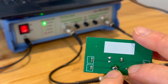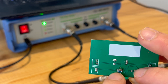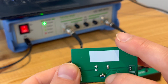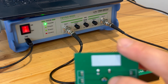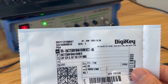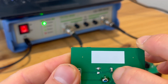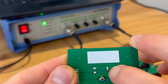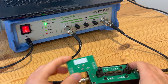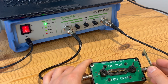Because the X2Y capacitor does not have the feed-through feature, I just added a tiny little wire to connect the trace. We have an 0805 100 nanofarad X2Y capacitor — this part is 100 nanofarads, 25 volts, X7R, 0805. And here we have another capacitor — same 0805 package — which is a normal 100 nanofarad X7R two-terminal capacitor. I can mount these on the jig and test the performance of each capacitor.